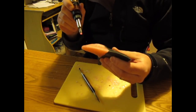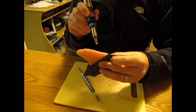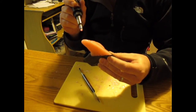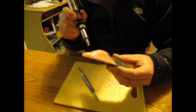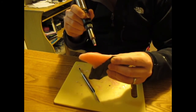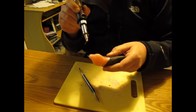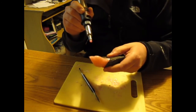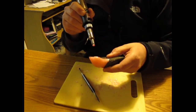The other thing you can do to texture these is when you've softened the surface with this little gas flame, press sandpaper, abrasive paper, into the surface and pull it away, and it leaves that rough texture that the roots have. I'm just working my way over and it just brings it up really nicely. Any bubbles that are under the surface will come up to the surface and pop, and they might leave little pits in the surface, so you just heat up the end of your knife and put it in the little hole and it'll melt the wax and fill it in.